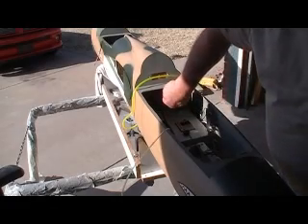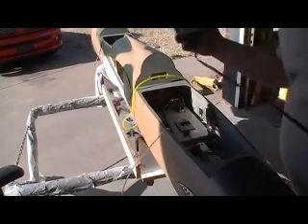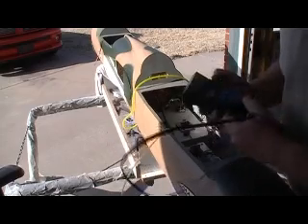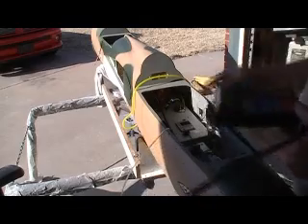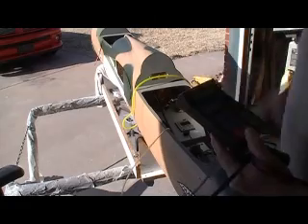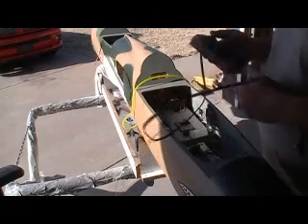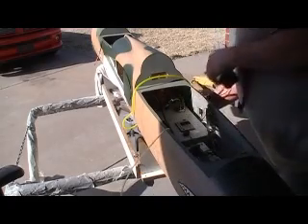That's our fuel valve — open that fuel valve. This is our ground unit. This is going to tell us our pump voltage, because if your pump's struggling, that's bad. It's set on six volts, so at full throttle you still shouldn't go up to six volts — you should be close. But we ain't going to run it up to full throttle on this stand. It also tells you the RPM, the engine temperature — just all kinds of information.